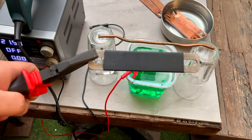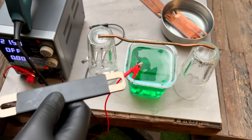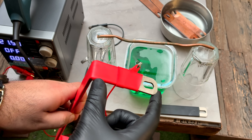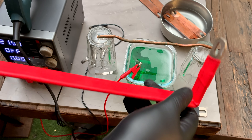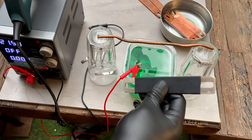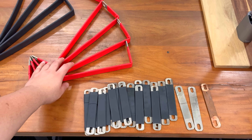That is easily one of the more satisfying things to do. You can see the finished product looks very professional — nickel-plated copper bus bar with insulation in the middle, which will be perfect for our upcoming battery project. I'll also show you a bigger version of the bus bar we made yesterday. On this one, only parts of the copper are plated and the rest is covered with heat shrink. These will be the interconnects between batteries, with some for positive and negative terminals. The heat shrink will protect the nickel, and more importantly the nickel will protect the copper.